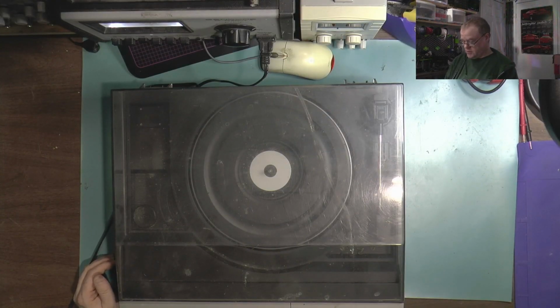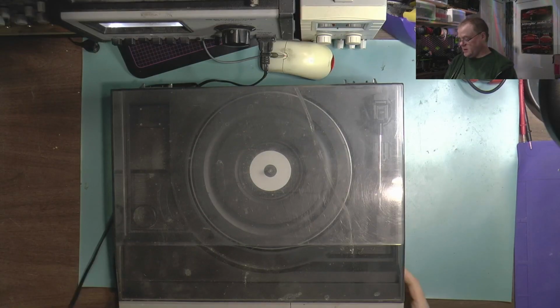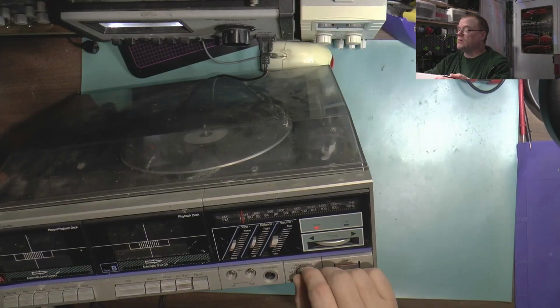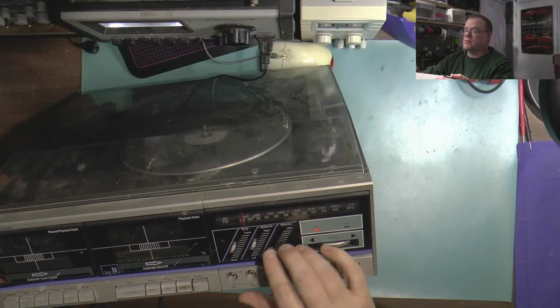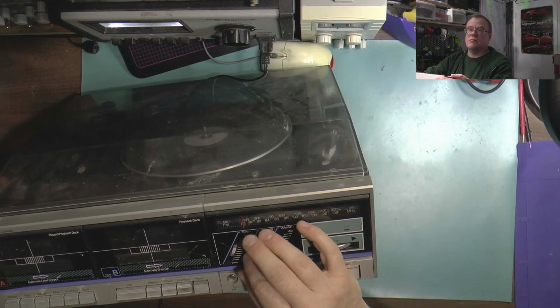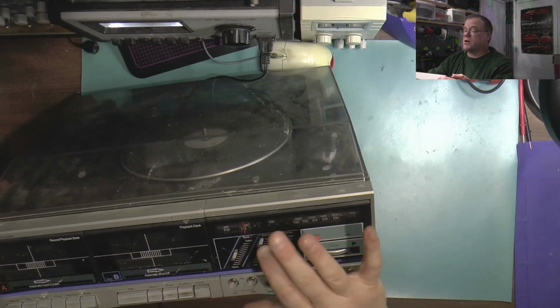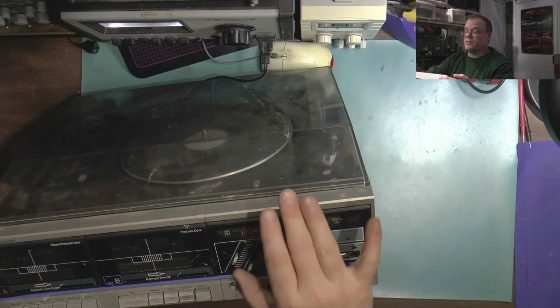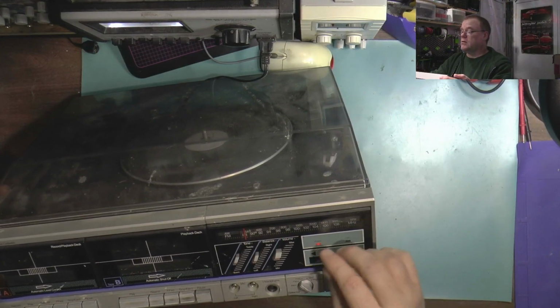Scratchy pots. Yeah, see the left speaker, there's very little there. It's all right side. And this could be related to the stereo. Okay, so the problem is in the stereo demodulator, not in the audio, because that's all left, right?